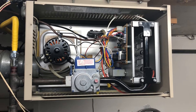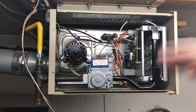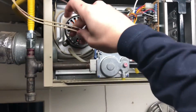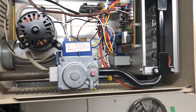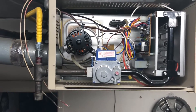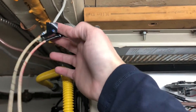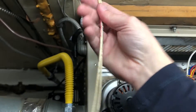With the side cover removed here, you can see the wiring setup. The wiring that comes in these heater units is simply two wires — they go in a hole in the back, come out, and run over to the circuit board. Because I was switching from a two-wire setup, I pulled those wires back. Basically I left this connected — this was the wire that runs down to that other thermostat. I just left it dangling here for now in case I had any issues with the Wi-Fi thermostat. I could remove this now, to be honest.